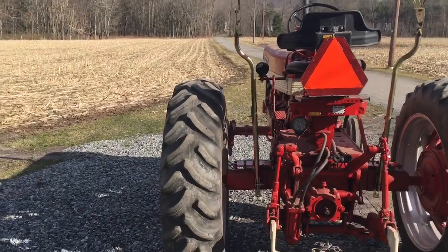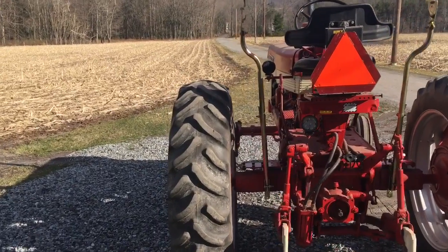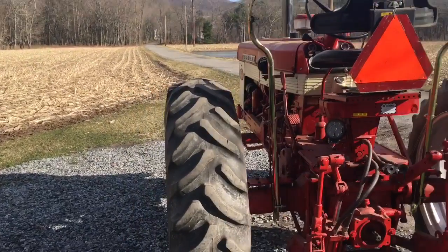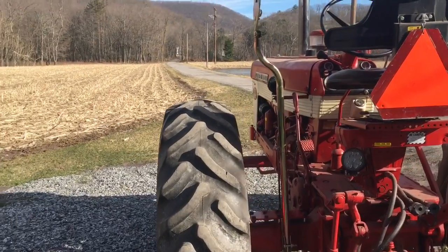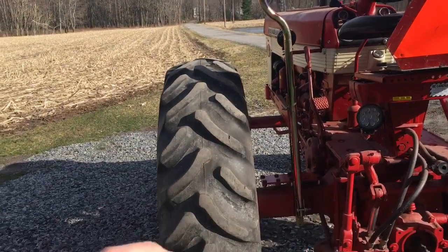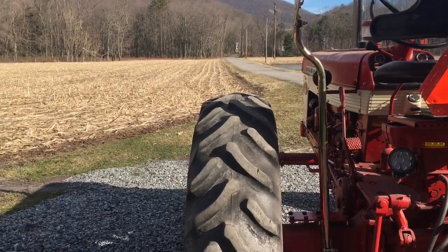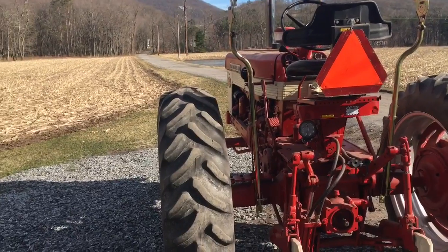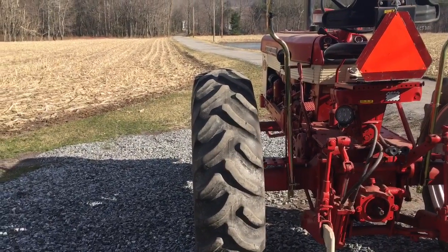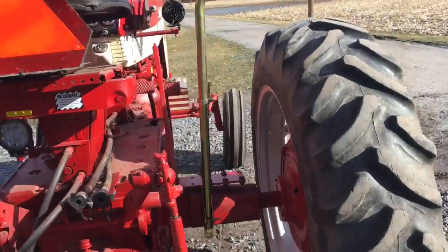The 395 wasn't charging when I first got it serviced and put back together. It wasn't charging, and I was digging through that. I had the dash ripped all apart, and turns out it was just the connection up at the alternator. Just had to wiggle it, and that started charging. The 986, same deal. Just had to wiggle at the wires, probably from sweating in the shed. The connection. So I have to get some of that dielectric grease and get that smeared all over everything.